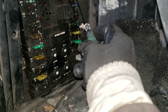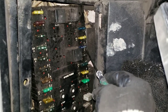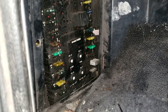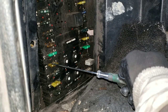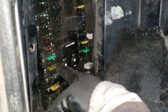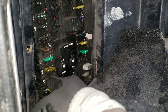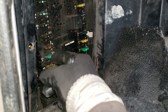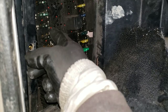So which one was loose? That 20-amp at the top? Let me check — try this yellow one at the bottom. See this one? It's kind of just dancing in there — look at that. That's a bad sign. A lot of these are like this. See how good this one is — I'm moving it but it's not as bad. This one's all right. But look at this one — this one's definitely got to get something done; look how it's just dancing in there.